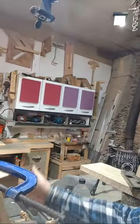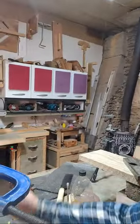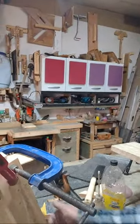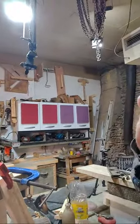The idea is then we can clamp things on. If I clamp there and a clamp there, I can have a piece of wood along the top, and I'll easily saw the end. That's going to go probably about there with the top, so it clears the ends of the legs easily when you're sawing. It's got just enough splay for its height, because it's only knee height, about the height of a coffee table. So you get your knee on it and actually cut your piece of wood.